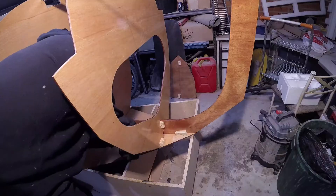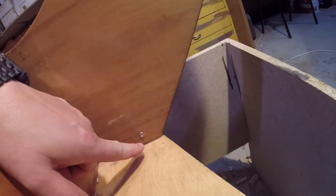What I'm going to do now is remove those cleats and hopefully everything stays in place, and then I can get some proper fillets on there and everything will be groovy. It turns out I'm not a very smart man - I very quickly ran into an issue. Here is one of the screws that I put in, and if you look at it closely you can see that there is epoxy all up in there. As a consequence, I can't actually undo it.